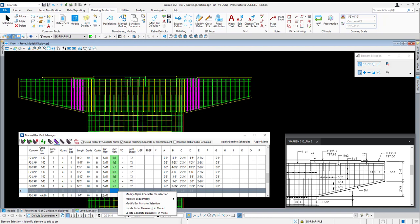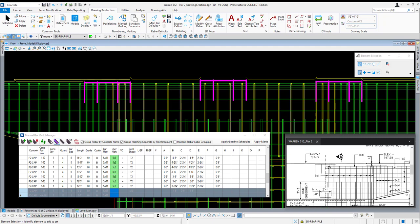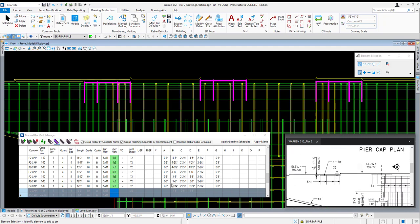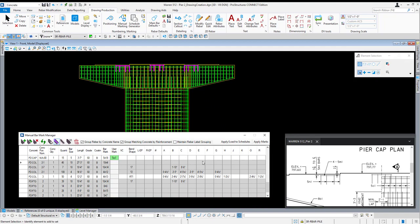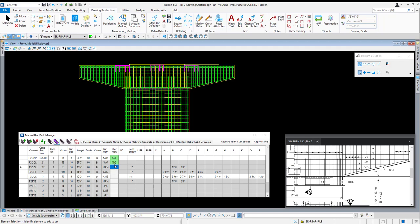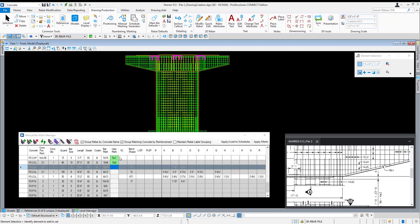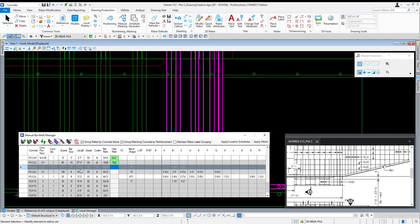Those are going to be 5N1 for our bars that are bent, and 5M1 for the straight bars. Now that we're finished with the cap, we're down into the column area. We have our 46 verticals there — those are going to be 10D2 if I'm not mistaken. Next, it looks like I accidentally applied some of the dowels to the column. Using locate rebar to confirm, I can double click on the bars and choose a different concrete element to change ownership. I'll enter 10D1 and then our standard T2 ties: 4E2, and then radial ties: 4E1.